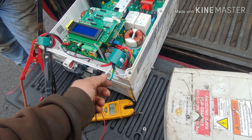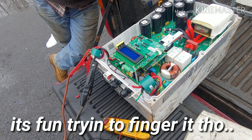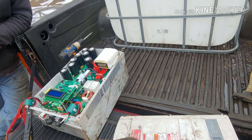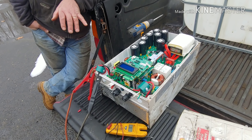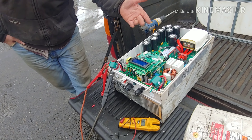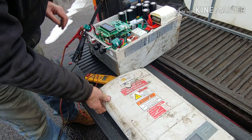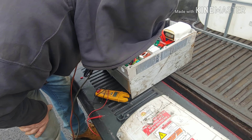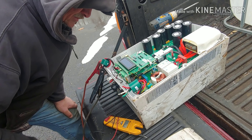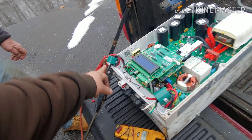There's some sort of big capacitor back there too. 110 to go in, right? Yeah — we're definitely probably going to have to put 220 in, right? Because this would hook directly to the panel. So you need to put 220 into this thing to get these relays to open up. This kind of reminds me of a UPS — if you don't put power on it, some of those industrial ones won't even power up. It's kind of the same way for like a golf car charger — it has to have 110 and DC on both legs to come on. So if you use this as an inverter to run tools, it's not going to work. Well, it would if we can bypass it somehow, or program it.